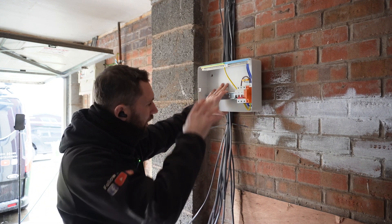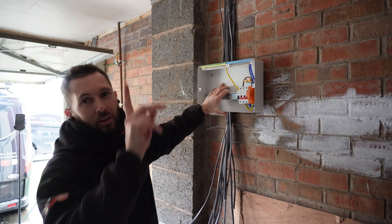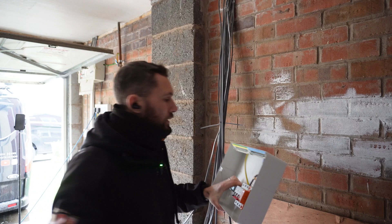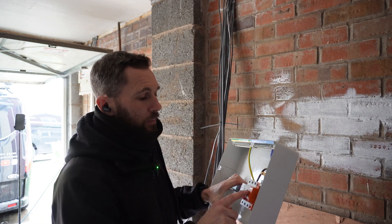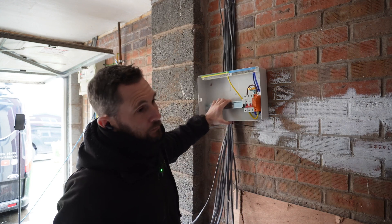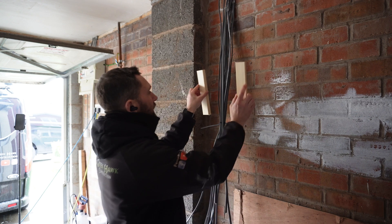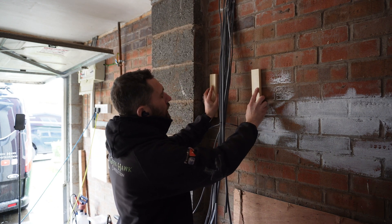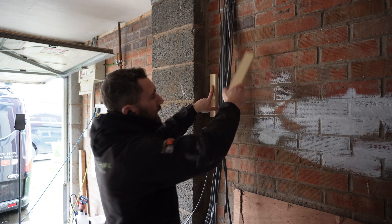Make sure that's all sorted — it's high enough away. Eventually there's going to be a double socket underneath and a lighting circuit in here, which I've still yet to do. The board we're using is a 14-way fuse box board with SPD. We've got timbers on the wall here. We're going to fit those on the wall, mount the board to them, run all the cables in the trunking, and go in via a rear entry.